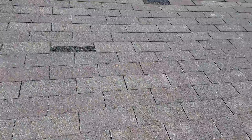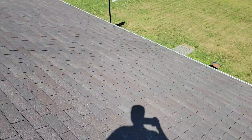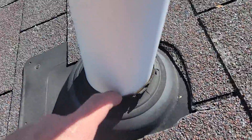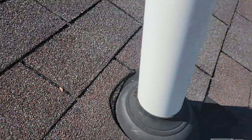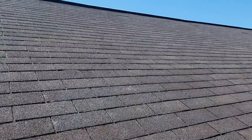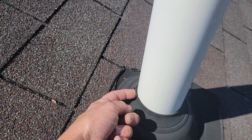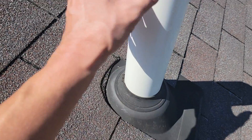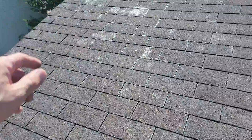Let's go look at the backside and why I got called here. This side has less wear, but still has wear. This is why I got called out - this little soil vent pipe boot right here. That is a problem, yes, but it's not as big a problem as the rest of the entire roof that's eventually going to develop issues. Most of the water running off the roof hits the pipe and goes around it. You can switch out the pipe boot and replace it - put a cover over it, caulk it. But the bigger issue is the roof is shot.